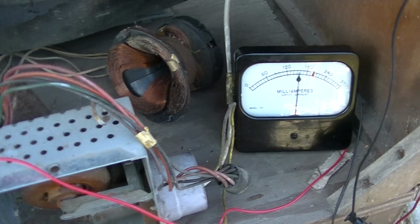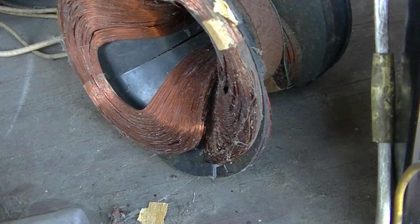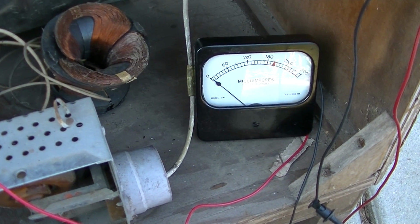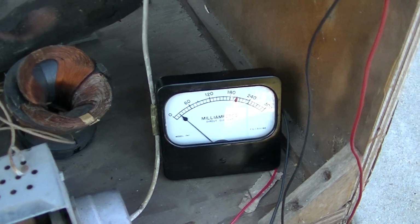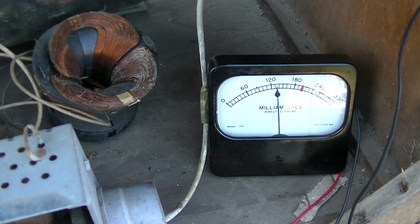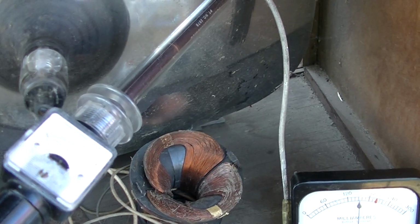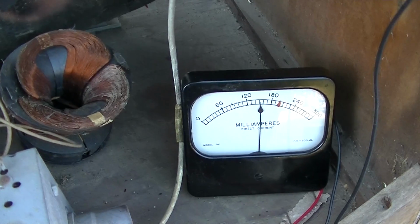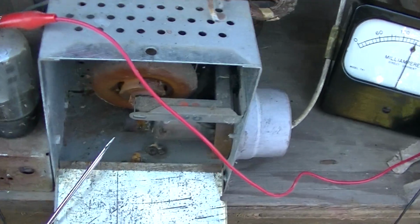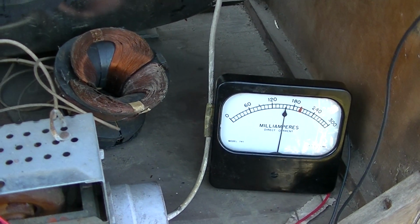So I took our light bulb out of circuit. Ooh! I pulled those wires that were arcing on the yoke apart. We'll see what happens here. I don't have very high hopes for this. I mean, now the cathode current is way too damn high. Yeah, still nothing. The yoke is a problem. Yep, the yoke is a problem.